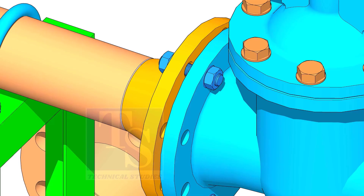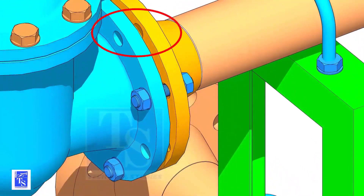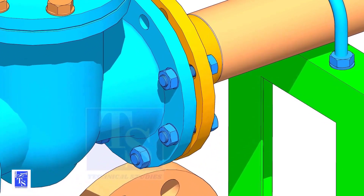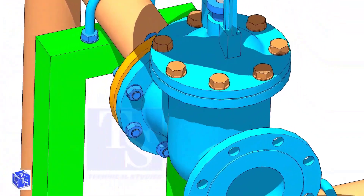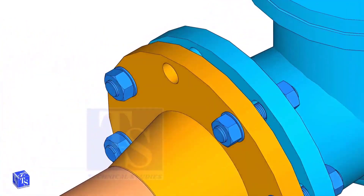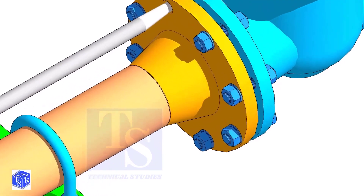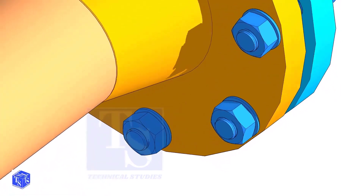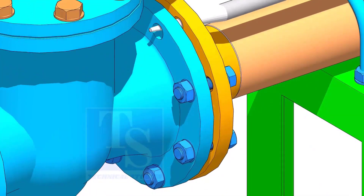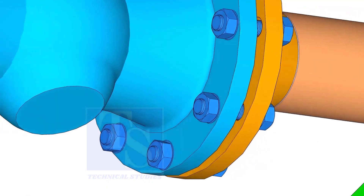I always use a piece of welding rod for this. Put a bolt on the top side, then on the sides as shown. Leave a hole on the top side to lift and rotate the valve. If the flange overlap, gasket position, etc., is within the acceptable limit, hand tight the bolt. Use an aligning bar for this. After slightly tightening the bolts, put the last bolt.